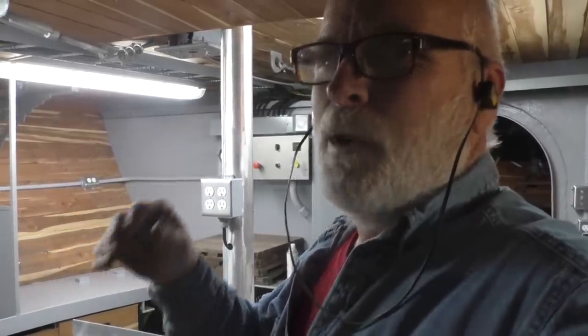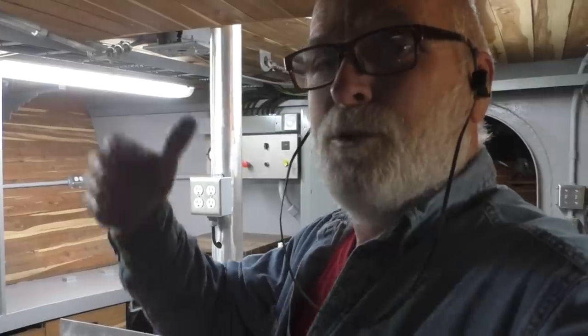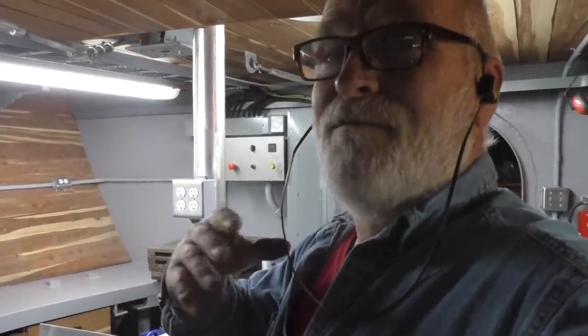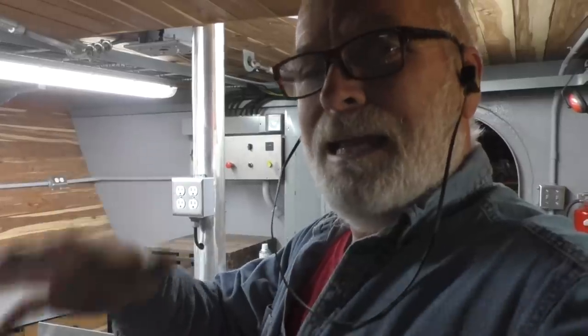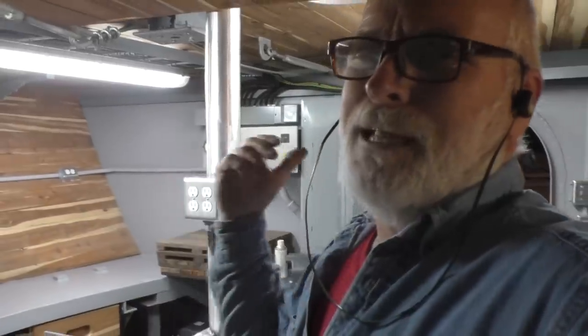So radiators are big in order to achieve that. We have a huge skeg, and the transfer of heat from liquid to another liquid, even through a quarter inch piece of steel, is very efficient compared to heat going from water to air. Liquid to liquid, very good transfer rate. So that means that what heat we do get back in this skeg, it gets passed off to the ocean relatively easily.